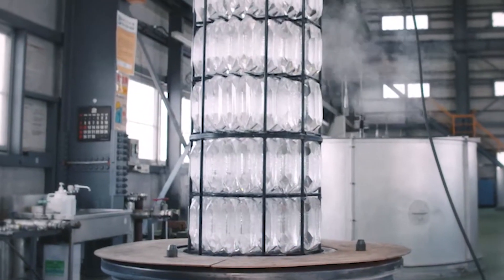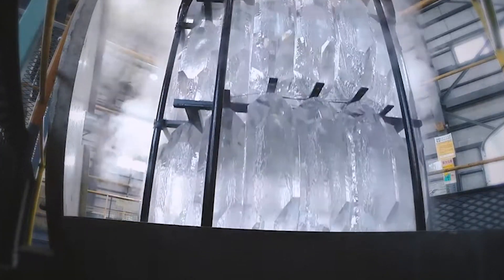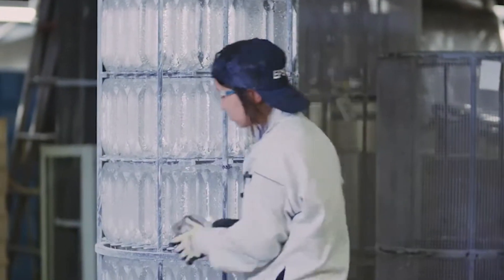Quartz crystal-based sensors are utilized — Epson not only produces the sensors, but we even grow the quartz crystals in a giant autoclave and tie that feedback directly into our servo motion control loop. All of that so we can manage that power and get the speed and precision that our customers require to maximize throughput on their production lines.